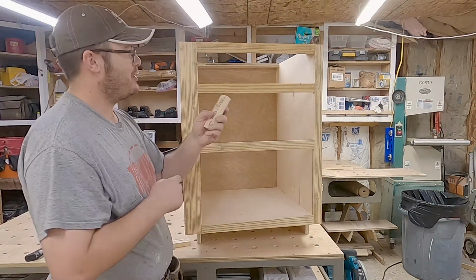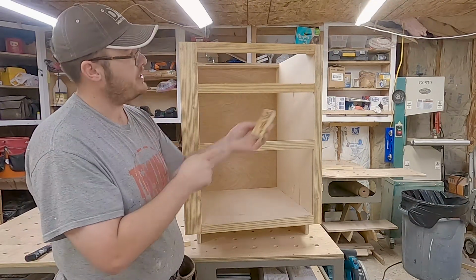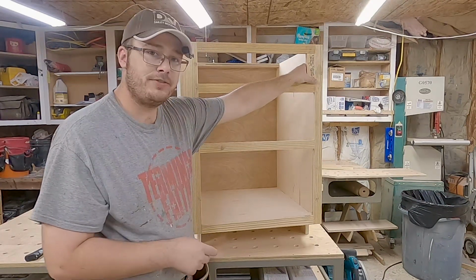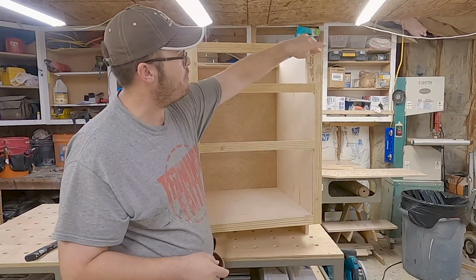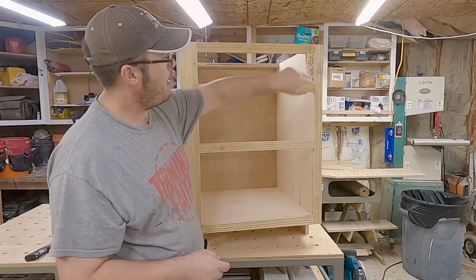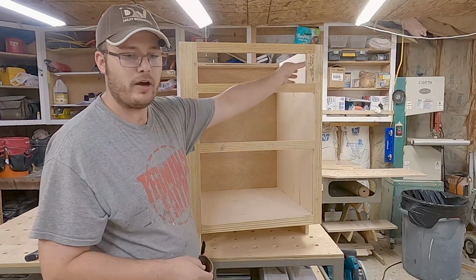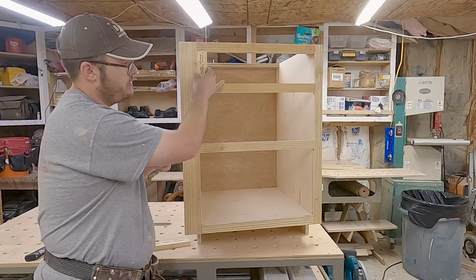And I'm actually going to put that on a shirt. There's a jig for that. So I have kitchen cabinet top drawer spacer, 5 inches. You can see that fits in right there, and when I'm building my face frame, I don't even have to measure or mark, because I just know I butt this board up, I build my rectangle, I butt this board up tight here, squeeze it together, run my screws in, and it holds perfectly. Same thing on this side, and I spaced it.